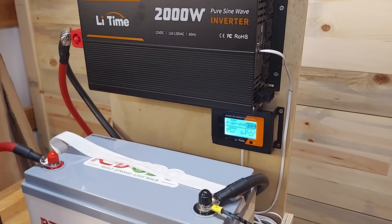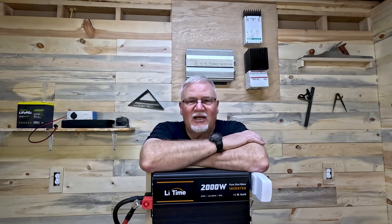I'm going to get this battery hooked up to the inverter — it's half there now, I just have to hook up the positive. We're going to turn things on and have a look at it. I'm going to show you how I hook this up and how you could use this as a power station — even a portable power station depending on how you build your box. And honestly, you don't even need to build a box. You could just hook the inverter right up to the battery and plug it in and go. In an emergency you could certainly do that without the fuses and breakers, though it's much safer to use fuses and/or breakers. But you could hook up an inverter directly to the battery and start powering something — it's just better to put the fuses and the breakers in.